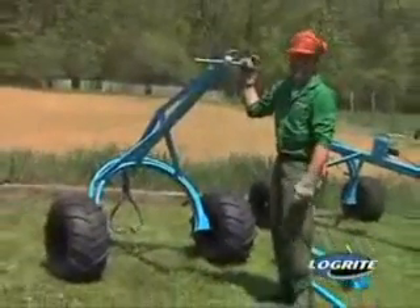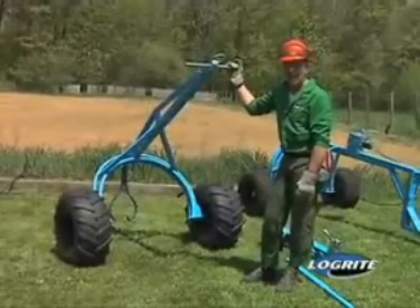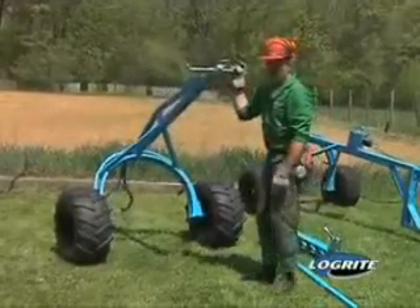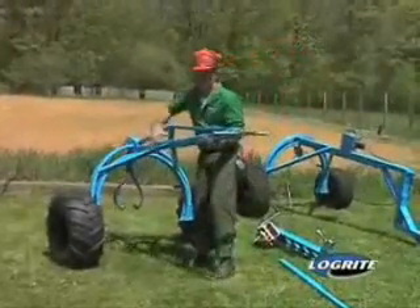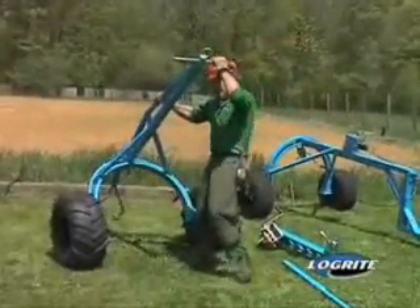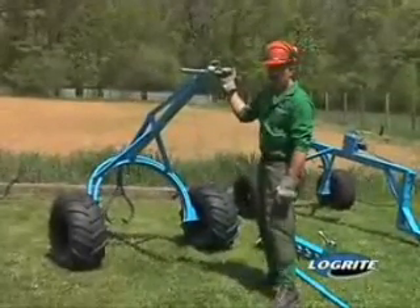This is a large arch for picking up large logs up to 25 inches in diameter and a ton of weight. It works with that same toggling action — the tongs that come from a casting on the back — a large structure for super strength through the reach, because this works in that prying, fetching action of picking up those logs before any pull.